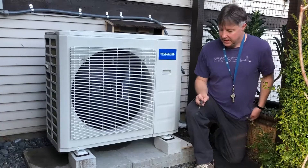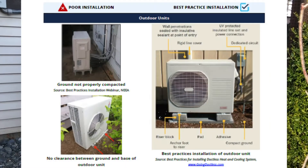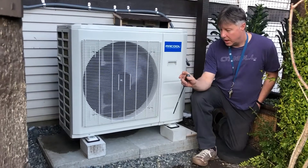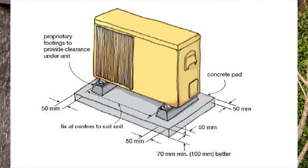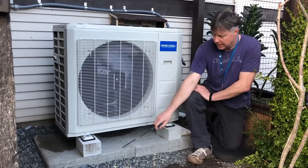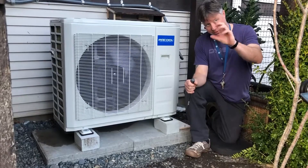I just want a quick chat about how I put the base down, because it's pretty straightforward. There's a BC guide that basically gives you a best practice guide for installing heat pumps and so forth — we'll put a link in the description. What I did is I dug down probably about four feet by two feet square, and about a couple of inches. Then I put some pea gravel down, compressed it with my feet, and made sure it was quite level. Then I went to the hardware store and bought two sets of slabs — four slabs in total — put one slab on top of the other, and altogether I've got about four inches of concrete depth between the two slabs.